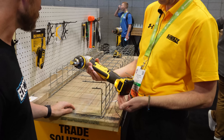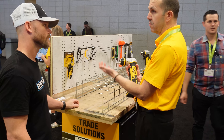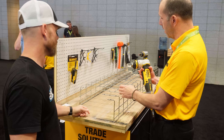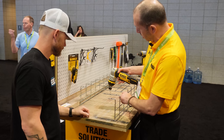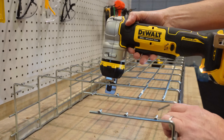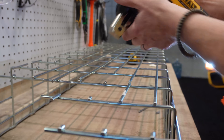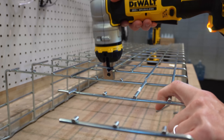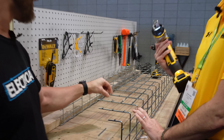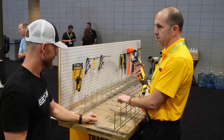Nice paddle trigger. What we're trying to do here is just make this job a bunch simpler. You've got people out there using grinders, snips, all kinds of things to cut these things — flaring up stuff in their face. So let me just show you real quick — it's a question of putting it in, reset it, putting it in and that's it. I can rotate the head if I want to cut this area out here. That's so efficient. What do you feel? It's not hot and it's not sharp. Exactly — that's the biggest thing we've worked hard on: there's no burr.